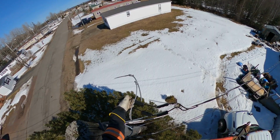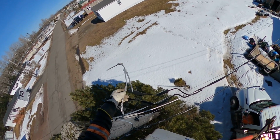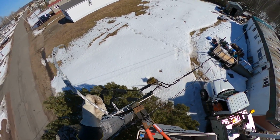You want to make sure you do have control of all your wires. You can see here all those crimpets. Those live connections are covered. However, if that were to fall in between that connector, we would have quite an arc flash on our hands.